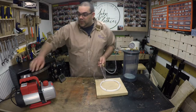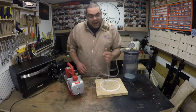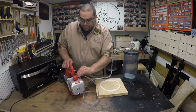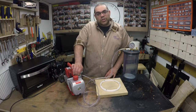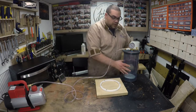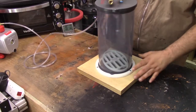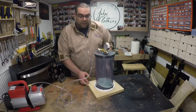Let's get this connected to the pump. I've got my vacuum pump and a connector — with the standard fitting it just screws on. Finger tight is absolutely fine; you don't need a spanner but you do want to make sure there are no leaks. I've got my bench ring screwed to my piece of plywood, so I place the chamber inside the ring and turn it. As you can see, that is incredibly solid — it's not going anywhere.